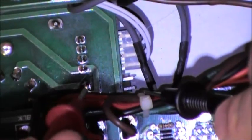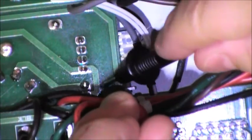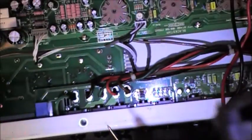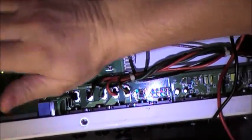And it's a tight space down here, and this is where you get into, is this for the fainthearted or not? Now I'm actually going to take the measurements from the solder points for these two terminals right here. Okay, you can see that, but I am going to measure there instead of trying to reach in there and get those two pins. Do not let these leads that you're going to use for taking measurements touch anything in the case. Do not lay your arm accidentally across if you're not paying attention.